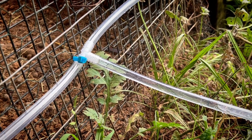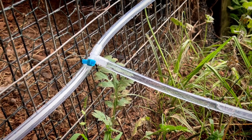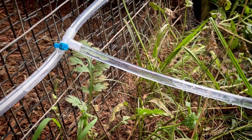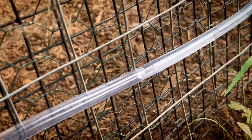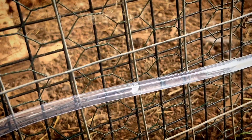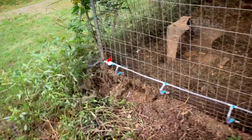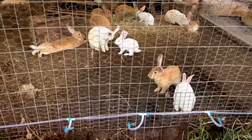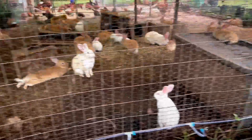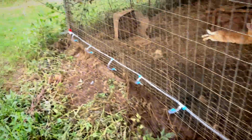As the tank fills up, the weight of the water in the tank is the pressure that pushes water out to your lines. It's going to take a little while at first, but you'll see it starting to flow. Even if the line goes up a little bit, it'll still push water through because it's all still lower than the water in the tank — it creates a little bit of pressure. The valve at the end is helpful here: if your valve is open, it runs the air out of the line so the line can fill up. Once you see water pouring out the end, close the valve. Otherwise you'll have air pockets, but those air pockets will move to the end of the line under pressure with the valve open, and then you can close it.